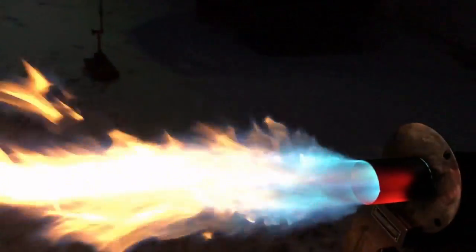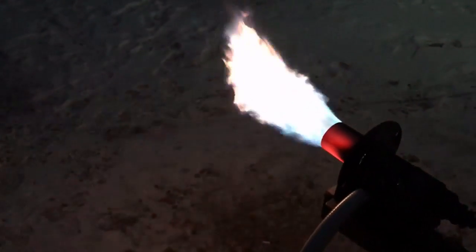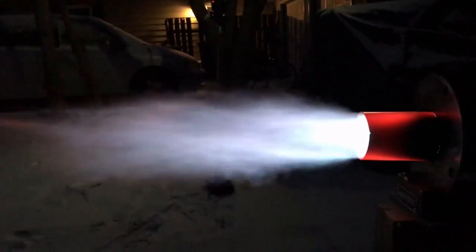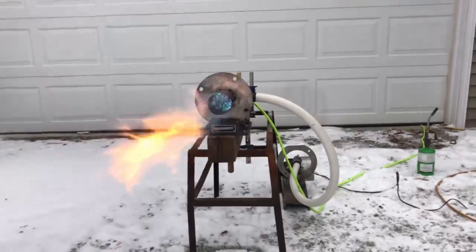This thing can definitely put out very high-powered flame. I was only able to achieve a maximum of 52 kilowatts of output gas on the propane bottle I'm using in the experiment. I have the bottle sitting directly next to a fireplace to get it as hot as possible so that we don't suffer boil-off during the test, and it did pretty well. I wish I would have had about five times this much gas to work with, because I believe this nozzle can do some pretty amazing things.